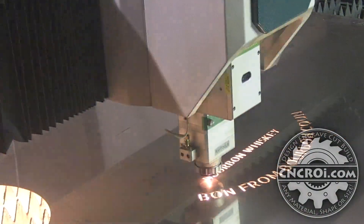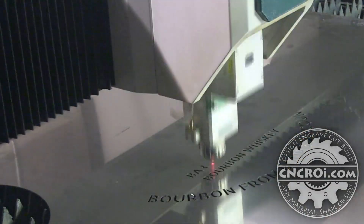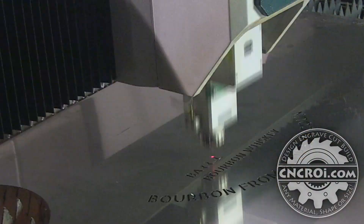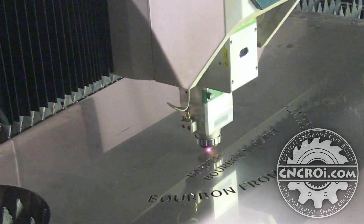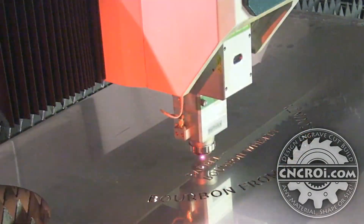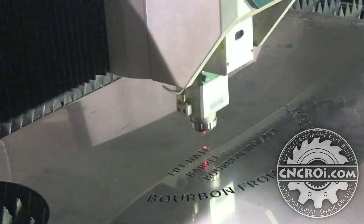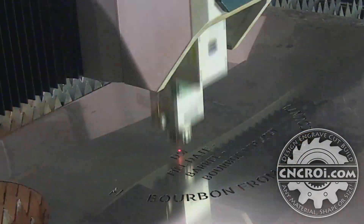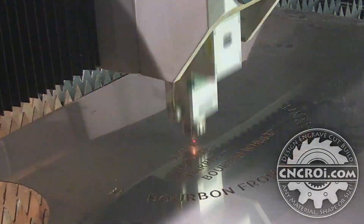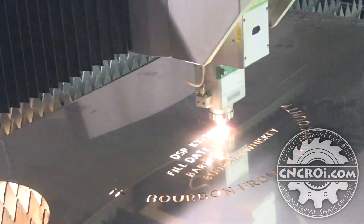What can happen is a collision. Now it won't damage the machine — the machine doesn't care, it'll just keep going. But what will happen is it'll push and pull the sheet, and that's another source of producing something that's off-center or inaccurate. The large stencil I had to do twice because something was off — in that case there was probably heat buildup and stress in the metal that was released. Dragging of the plate would produce the same result — meaning some things end up misaligned.